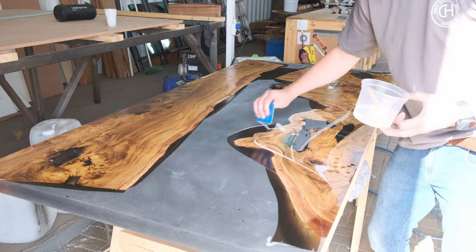Step twenty-one: fastening your steel base to the underside of your table. We used to use hex screws at the beginning, then moved to threaded inserts for a cleaner, smoother look. From our last four tables, we started using base plates on our steel bases for a better fastening surface, making the steel base much more secured to the underside of the wood.